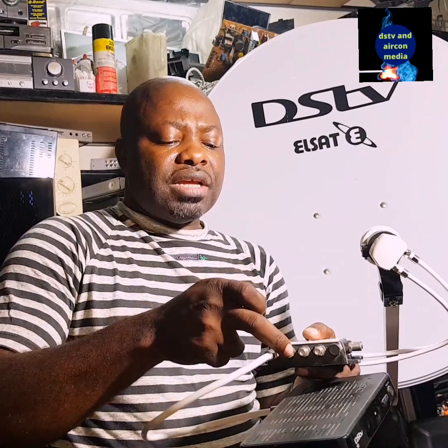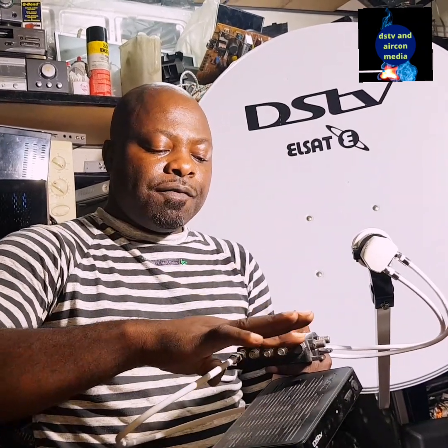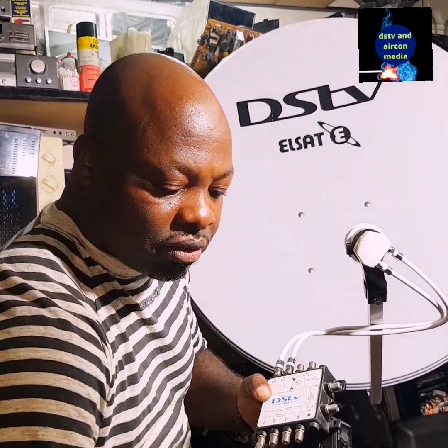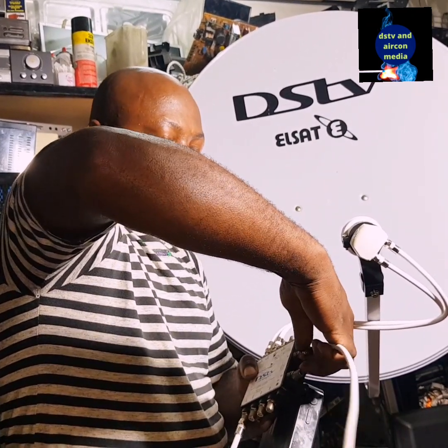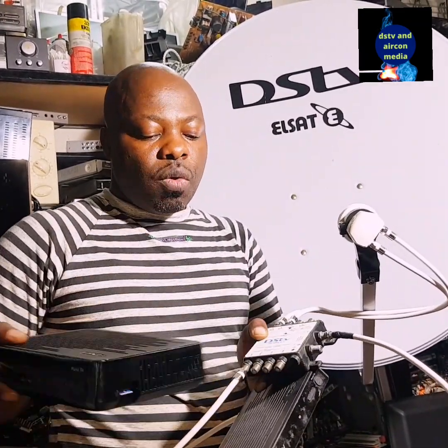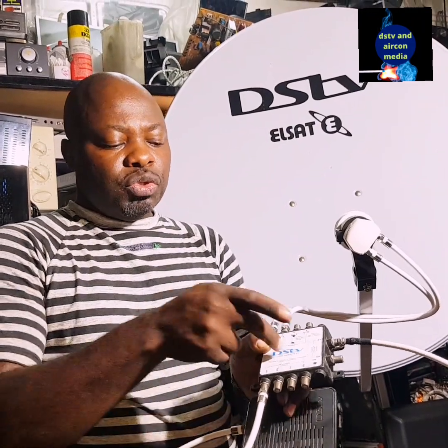You can connect your OVHD here, your neighbour here, and your tenant here — so four decoders total on the Universal outputs. What is also interesting with this box is that it also has A and B unicable outputs. From the unicable port, within less than 100 metres, you can now connect an Explorer decoder. Even though you have four decoders on the Universal ports, you can also connect your Explorer from the unicable port — up to two Explorer decoders — while still connecting other people on the universal outputs.